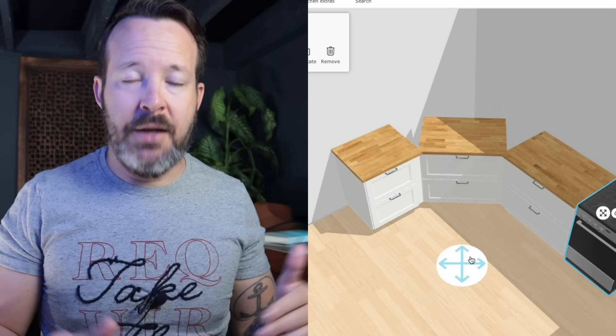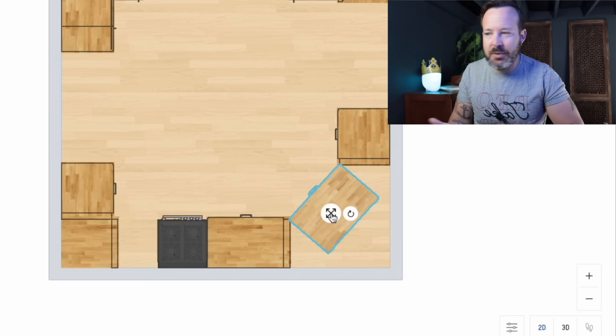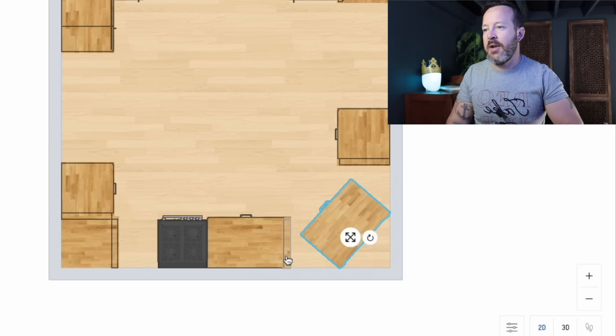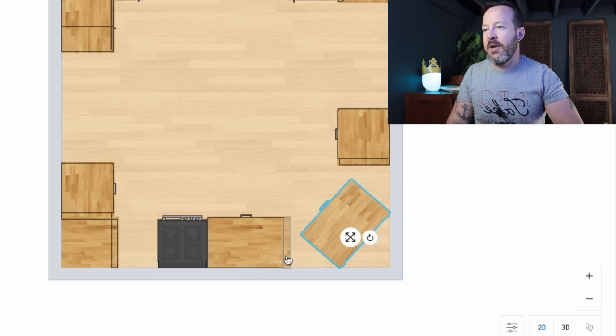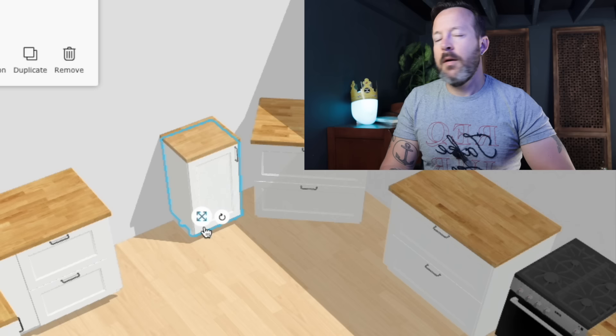The fifth way of designing a corner base is to also take a regular cabinet on a 45-degree angle, but in this case we do not want to pull it out from the wall. For whatever reason — maybe it's design, maybe it just has to be this way — you have to have this cabinet right back to the wall. Now you have an issue because the two cabinets on both sides with their fillers are going to overlap. So there are a couple of options — I'm going to show you two of them, which I'll call option 5 and 5.5.